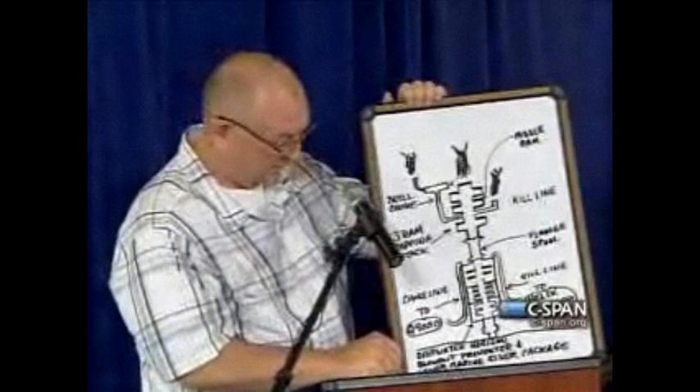Last week, as you remember, we removed the stub of the riser pipe and we put in what we called a flange spool. On top of that, what happened — which was significant — is we've now seated the capping stack here and it basically has three rams. It's a mini blowout preventer. It also has a kill line and a choke line. So you basically have a small BOP on top of a larger BOP that is legacy to the Deepwater Horizon.